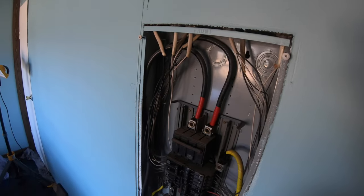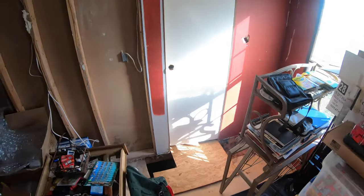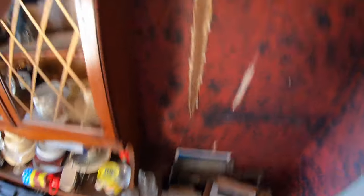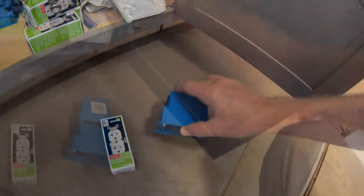It's not getting enough power, but it's getting some power to the outlet. I took a little digital clock and turned the power on — I have power at this plug with the breaker on, but I don't have light and I don't have power in the other plug, which is probably the direct opposite of that plug. I'm about 90% sure they're wired together.